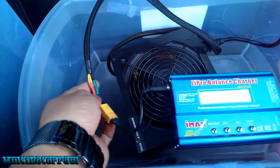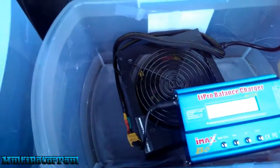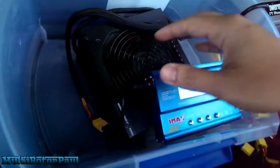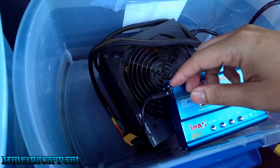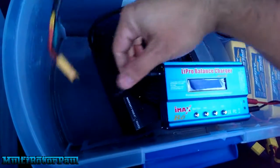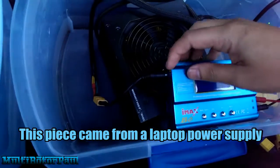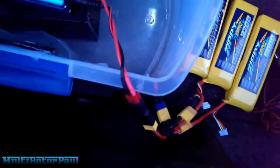There are some write-ups on the internet on how to do this. This is just an extra power supply that somebody gave me — they didn't need it anymore. I opened it up, cut off a lot of the wires, covered them with shrink tubing, and then put this XT60 connector on here. Then this is just another cable that fits nicely into this, and it works pretty good.